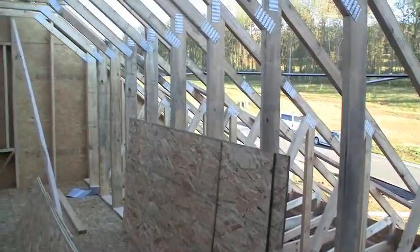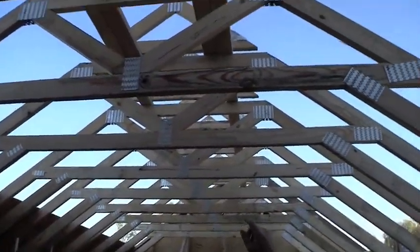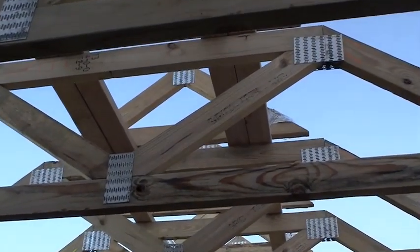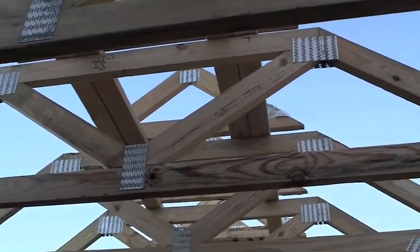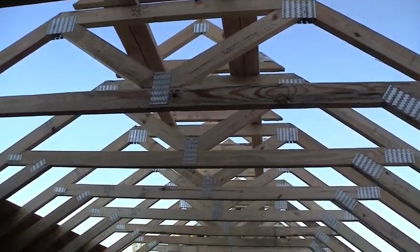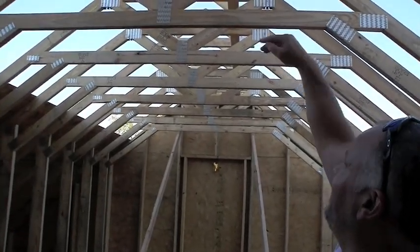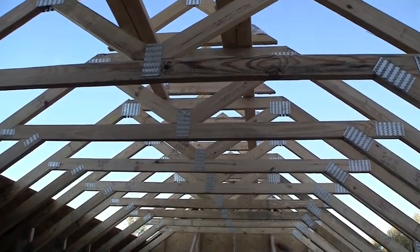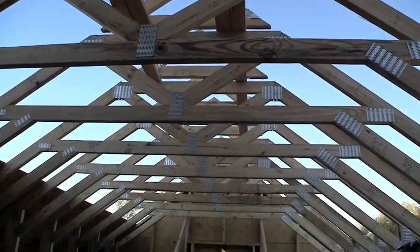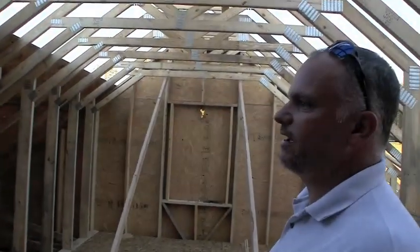You can see the OSB on this side here. There are these extra little small trusses — tiny rafters — put on top. The reason they're added up there is because the trusses are so big that the truck couldn't haul them on the road. So that last 18 inches they actually have to put on site — that's just to get your peak in the roof. It's not a scary structural thing; it just helps them be safe when driving down the road.